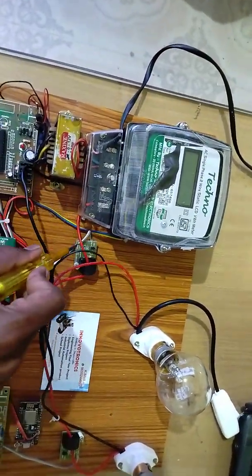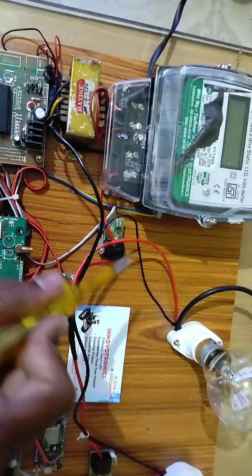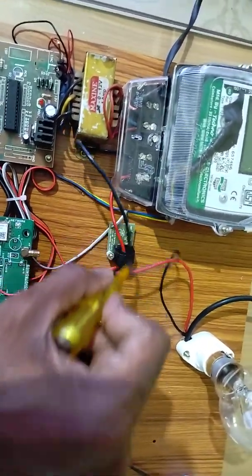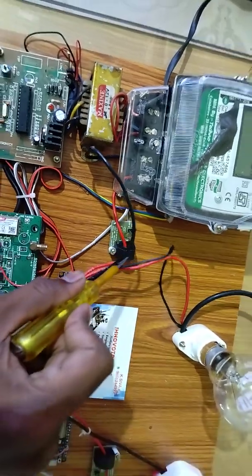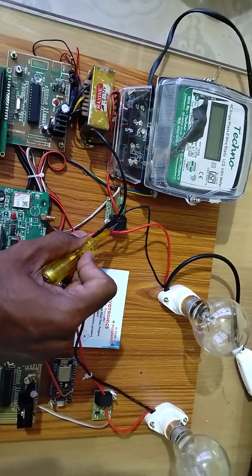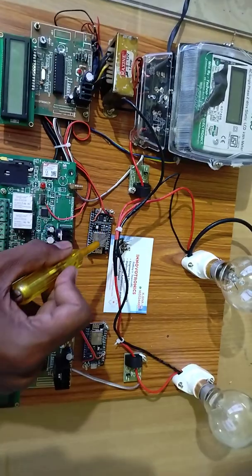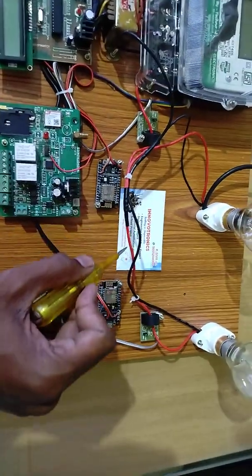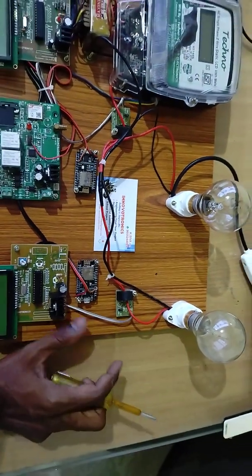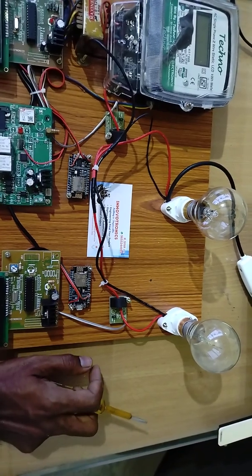This red line comes to one CT coil — you can see this is the output line coming from one CT coil. We are using one CT coil to find the total power of the load, which means this CT coil measures how much current we are taking. The same power line is also going to this second CT coil. So in this project we are using two CT coils in order to monitor how much power we are consuming.